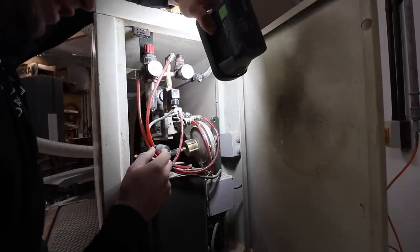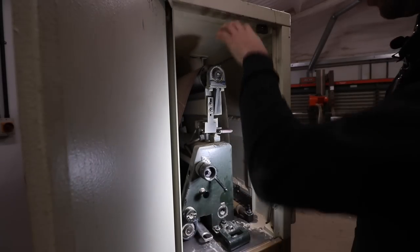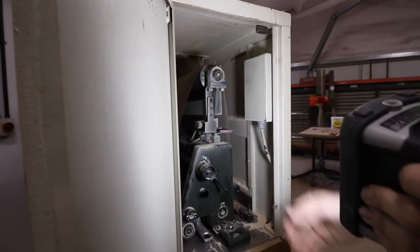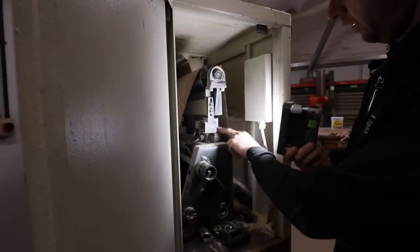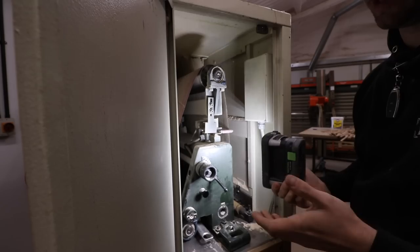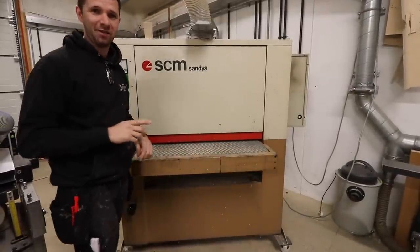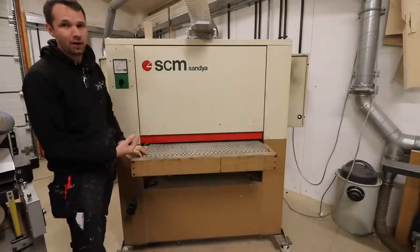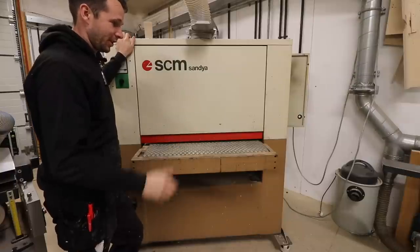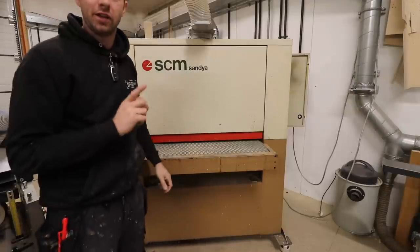The machine needs air power in order to operate — there's an air pressure sensor switch linked to the electronics, so if it hasn't got the appropriate air pressure it won't let you turn it on. The same goes at the other end with the belt change button: that needs to be pushed in with pressure on the belt to engage. There are also a couple of sensors on the belt — if these are triggered, the machine will cut out or not turn on. One more thing: if you raise or lower the bed to its limit switch, it cuts out the electrics too.